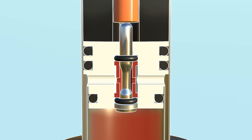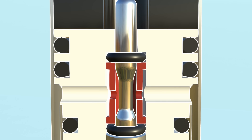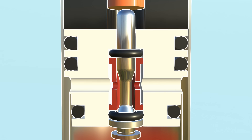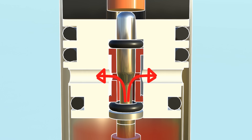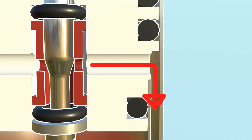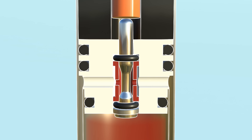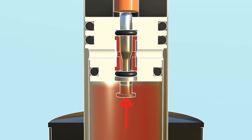Let's take a close look at the construction of this valve. There are two o-rings around the valve stem. One of which leads to the outside and stays closed. The valve stem has a narrowing that allows air to pass the other o-ring when it's pressed down. The gas then escapes through one of these tiny holes through the bigger piece of plastic into the double wall, which is connected to the other chamber. But in essence it's just two o-rings and a little piece of metal - and I think that's brilliant. Just like this whole contraption, this piece of metal doesn't even need a spring, because the pressure inside pushes it closed.